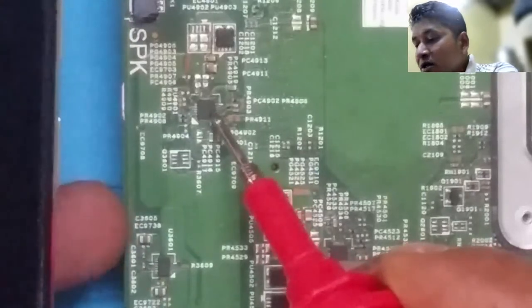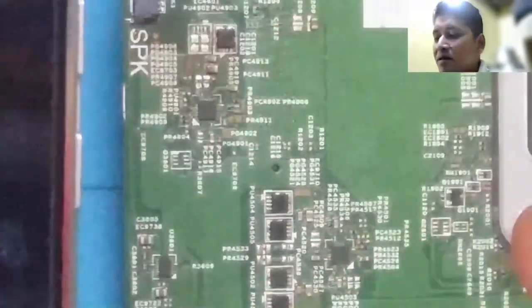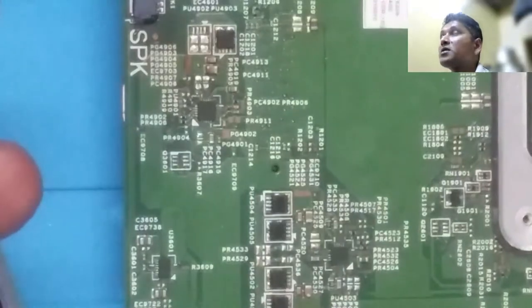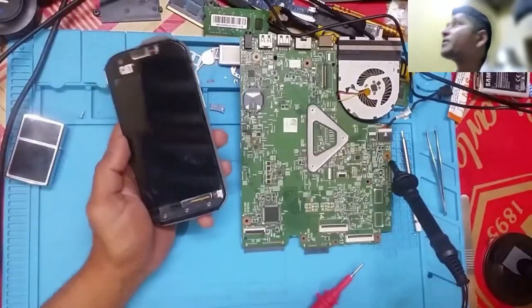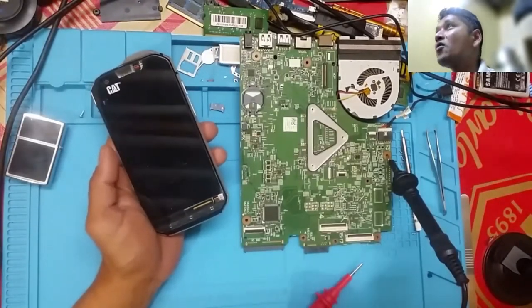This is a chip — I don't know what chip that is. I did check it with my thermal cam. I'm going to call it the clear cam. So when I inject one volt with one amp here, this chip gets very hot quickly. I will show you guys when I put this phone onto that spot — it's going to show us a bright orange light. That bright orange light means that chip or that component is overheating or heating.